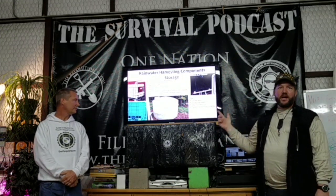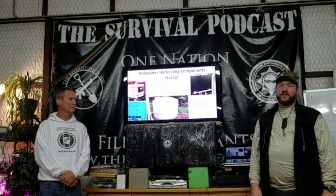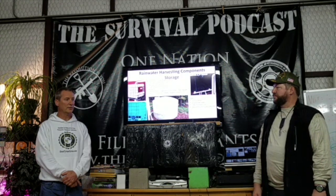Those bladders will pull out, so you just undo the top of the metal rack, and those bladders just pull out, especially when they're empty. They're super light. My wife and I, my wife is like 125 all day, so we just together pulled it out and painted it all. And just put a couple coats, make sure it's thick enough so it doesn't allow light to come through. Right, UV. Yeah. So that's to protect the plastic itself as well as prevent a bunch of algae.